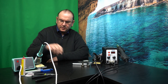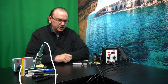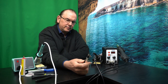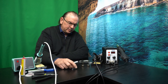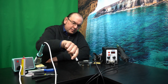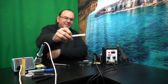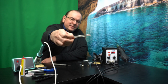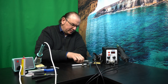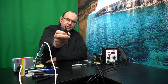I've had situations where I used the conventional soldering iron and the suction method, and the component was still very stuck. So I just applied a bit of extra heat from the hot air gun and could then take it out. There's also a little suction mechanism here — combined with different types of very small suction cups, you can pick up tiny components like capacitors. Each of those individual little cabinets holds a small capacitor, so you can grab one and position it on the board. And then you need the requisite number of different types of tweezers — different packages will contain different types.